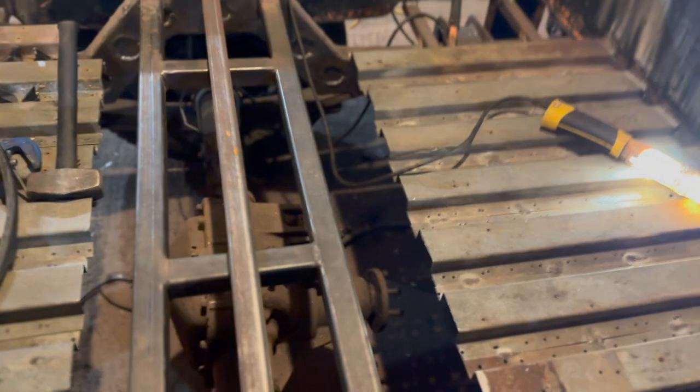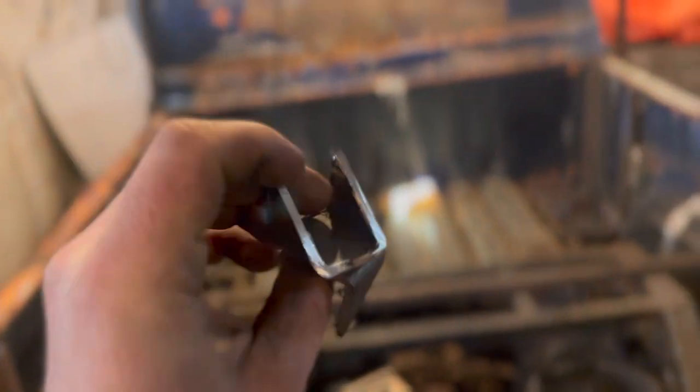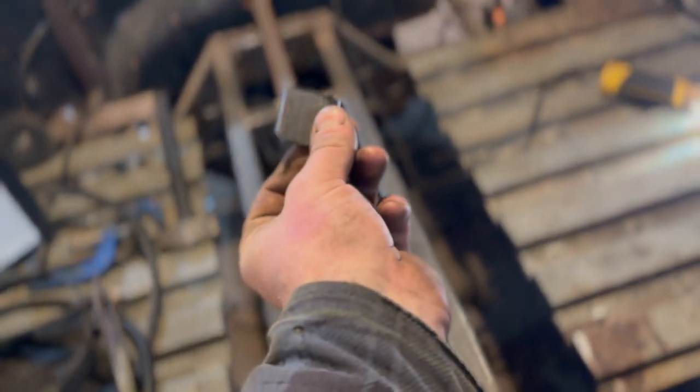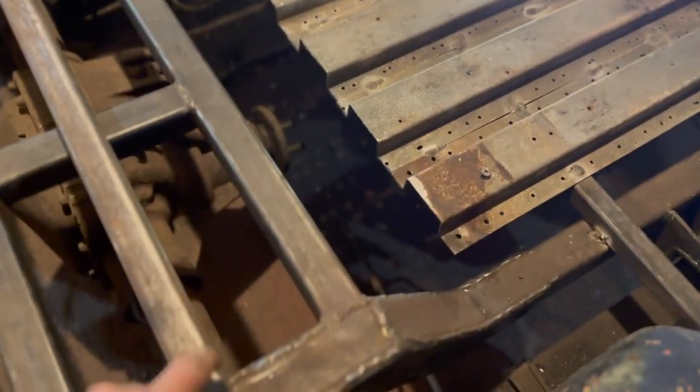As for the crossrail, I'm thinking one singular crossrail going across. I made a bunch of these little guys — we're going to drill a hole right in the center and that's where the bolt's going to go. The premise is it'll go like that, and on the other side I'll cross it — one like this, one like that. On the frame side, same thing: I'll weld one to the frame on each side, drill them, then I can bolt that guy down. Then I can build my arch, but I have to have this guy bolted down first.